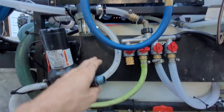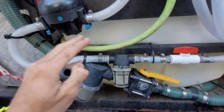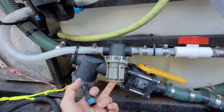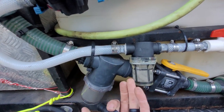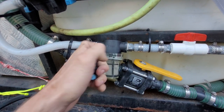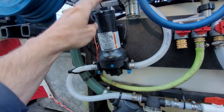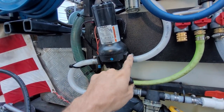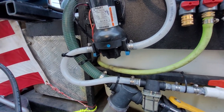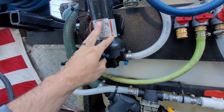This is my feed — it goes to my tanks. I have a filter here and a filter before my 12-volt pump. This is a big filter for my pressure washer. It's nice to have a filter before the pump — it'll help the life of your pump. These are cup filters; you can find them all over the place. They also have Y-filters and all kinds of strainers. These ones are clear, easy to inspect. This is all three-quarter — three-quarter barbs going in and out, running right to the pump. I like three-quarter because this is a Flojet, and Flojet has three-quarter inlets.